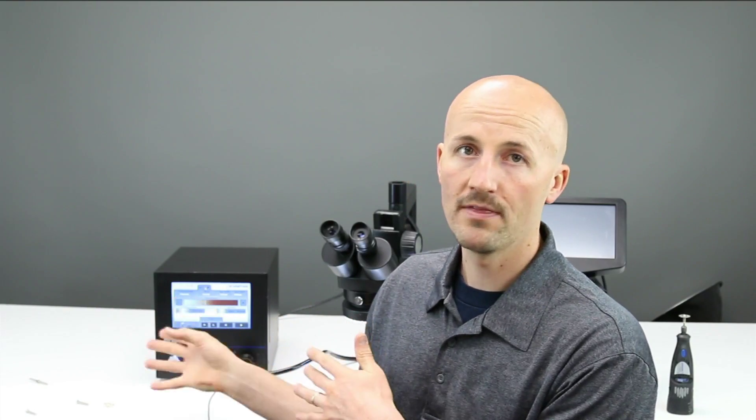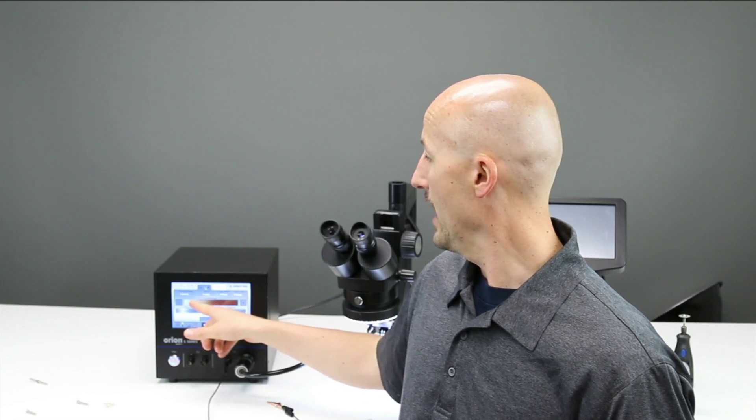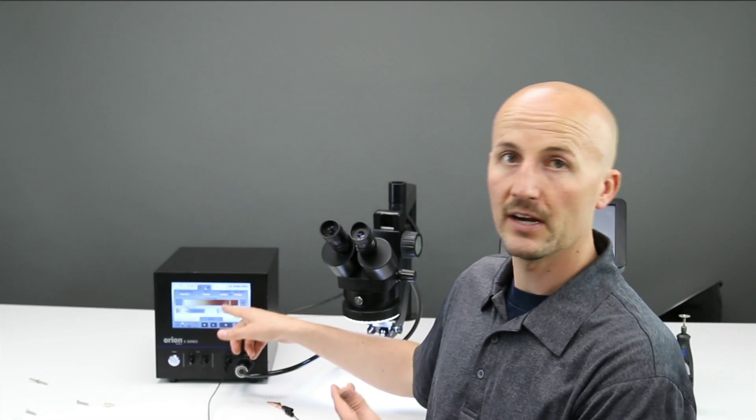On the Master Jeweler Plus you would use one dial to change to energy or time, and the other dial to adjust those. Our suggestion has always been to have your welding time or duration at max — 100% or whatever the max is, depending on where your energy is at. On the 150S, you would change your power or energy here, and depending on that level, it would tell you the time. At 83 watt-seconds of energy I'm at 60 milliseconds of time; at 9 watt-seconds I'm at 15 milliseconds of time.